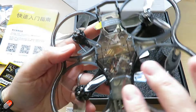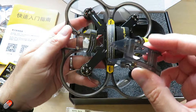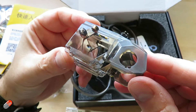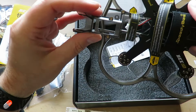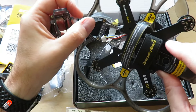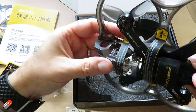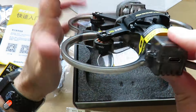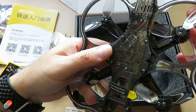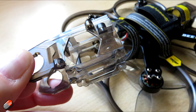The flight controller in the middle of this is a brand new F405 all-in-one. I'm hoping to do a video soon about another one that's coming out as well. The flight controllers that SpeedyBee are making — they've had a couple of issues in the past, but they really seem to have got to grips with that now. It has all the cool stuff, including the ability to run the Meteor LED strips. The power combo is 1404 motors — quite powerful. The cages at the front are all designed around the O3 Air Unit, the Vista, or the RunCam Link — it's all the DJI versions of stuff.